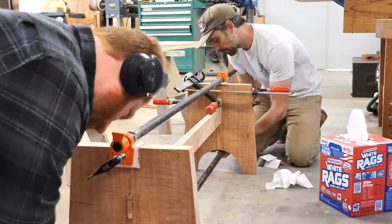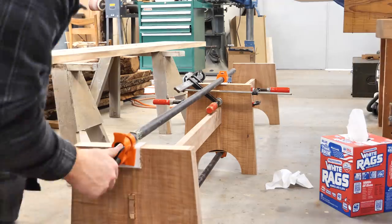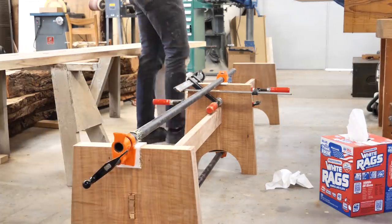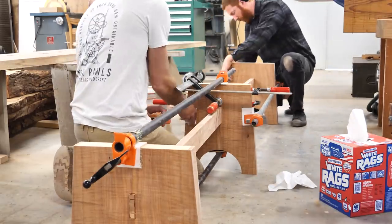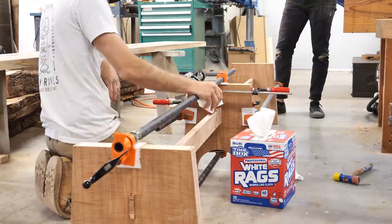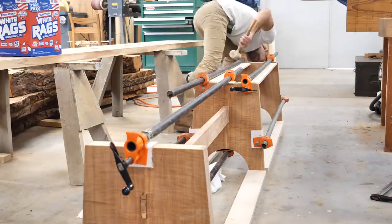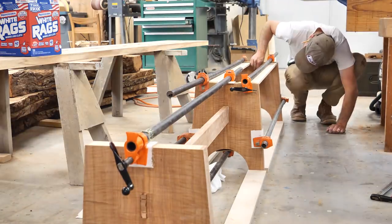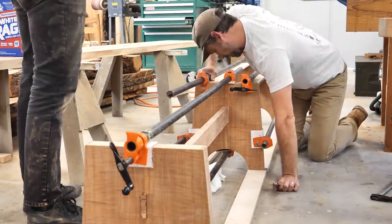Finally, what we decided in the middle of the glue up was to make spacer boards that we could fit in between the two uprights, and you're about to see those right here. Those help keep things locked in. If they're all the same length and the proper length, you should be able to just pull tight to those and everything be lined up. And it works pretty good. We didn't get it dialed in exactly perfect, but we were pretty darn close.